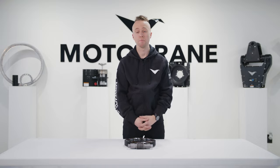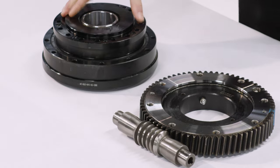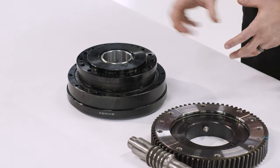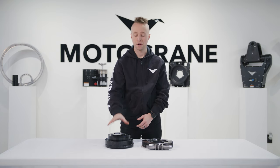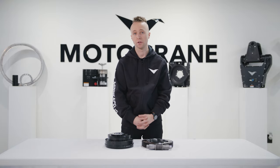After years of research and development and design experience, we decided to finally take matters into our own hands and create a drivetrain that gave us the best of both worlds. We created the synchromonic powertrain which uses this as a primary means of gear reduction. This is a strain wave or harmonic gear reducer, which is a zero backlash, very high efficiency, very high torque output gearbox.